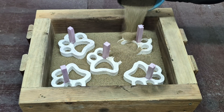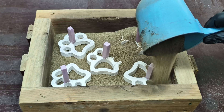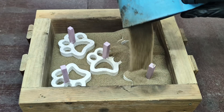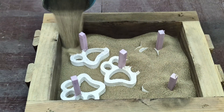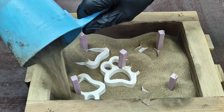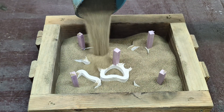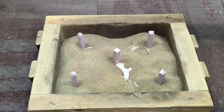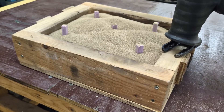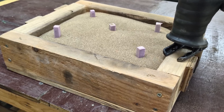If you're new to my channel and this is the first time you're seeing this, this is called the lost foam casting process. I do this type of casting all the time — it's so simple, almost anybody can do it. You just have to fill the container with dry sand over the top, completely covering the foam. Once filled to the top, vibrate the flask to get better compaction on the sand surrounding the foam pattern.